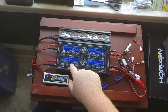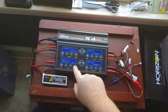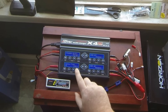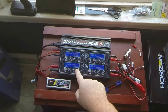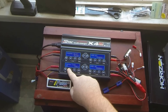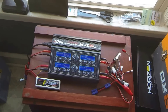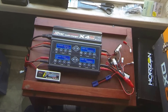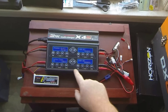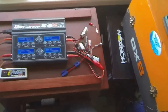I usually like to put five to ten minutes of waste time if I'm doing charge-discharge on my NiMH batteries. For the safety timer, if you're doing five charge-discharge cycles you either want to crank the minutes way up or just turn it off. Since I mostly do LiPo, I leave it on, and if I get interrupted in the middle of a charge-discharge, so be it — I just do it again. I'd rather be safe. This one is set for 300 minutes when I do nickel metal.